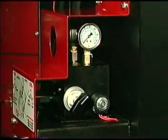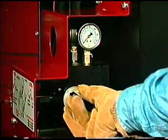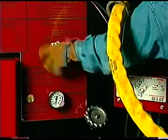Heated hoses can be put away full, but over time, sealant may build up and constrict flow. It's a good practice to backflush hoses to prolong their usefulness. With the wand inserted in the access port and hot material flowing, reverse the material pump direction at the hydraulic manifold. Leave the wand valve open to avoid deadheading the suction.